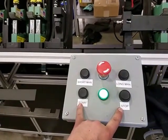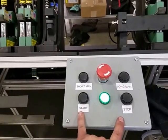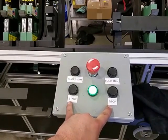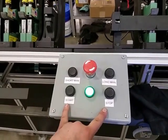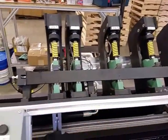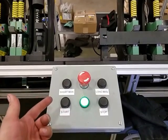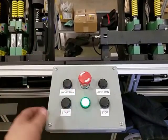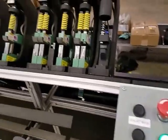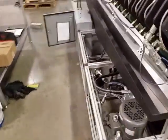If the machine runs for 5 minutes without being cycled, it will go into a cool down feature which allows the coolant in the tank to just run through the cooler. You'll see this light turn off the minute an operator goes to punch another part. The machine will turn back on and it will build pressure and then cycle the part, and at that point the 5-minute timer resets. At 10 minutes the entire system will shut off, which is a power saving feature.